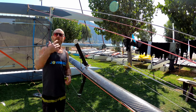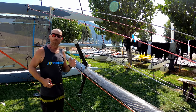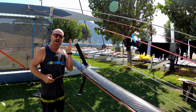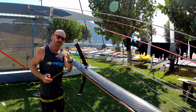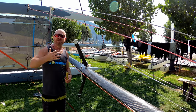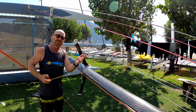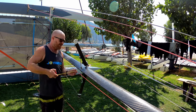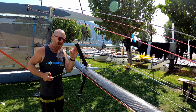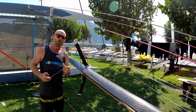For windier conditions, we want more tension in the diamond wires. For moderate wind, wind that up to 37, and for high wind up to about 40 with the carbon mast. More bend in the mast allows more downhaul to flatten the sail, making the boat faster especially upwind. At that level of tension, the distance between the trailing edge and halyard will be much greater — about four centimeters with a small amount of spreader deflection, and more with greater deflection.